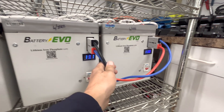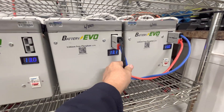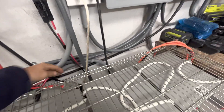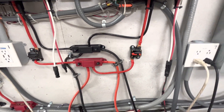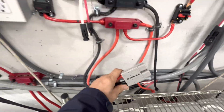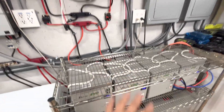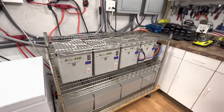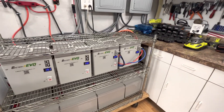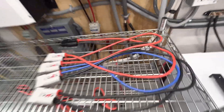We had this set up. I had to buy this extra series cable to make this go from 12 to 24 volts, and it actually is an Anderson quick disconnect that connects right here to my 24-volt system. I have the second one here — I had it connected yesterday with the exact same thing connected to these two, charging them up, then discharged them overnight. What I have left is 13.1, 13, 13.1, and 13.1.